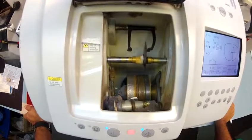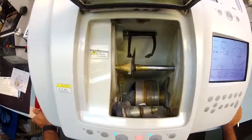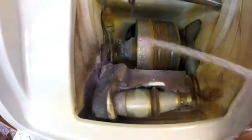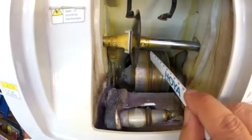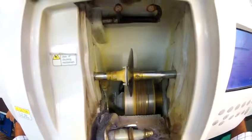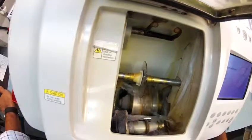It's tracing the concave surface first, which is the rear surface — the back surface closest to your eyelashes. Then it's going to move over and trace the convex side of the lens, which sits away from the face. Now this wheel on the bottom is the actual cutting wheel — that's going to grind away your lens material until it's the final shape. This wheel in the center with that little channel, that bevel, is what's going to put the bevel onto the lens so it stays inside the bevel of the frame. I'll close the door, but for now I just want you to see as your prescription lens touches down onto the cutting wheel.